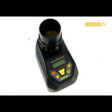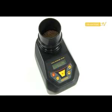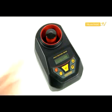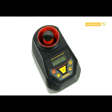After filling the measurement chamber, do not move or shake the device. Confirm the measuring process by pressing the OK button. Under the name of the sample, the information 'analyzing' will be displayed. After a while, the result of measuring the moisture as a percentage and the temperature in degrees Celsius will be shown. After the measurement, the chamber should be emptied and the OK button pressed. The command 'pour-in sample' will appear once more on the display, meaning you can repeat the measurement of the same sample or check the humidity for another sample.